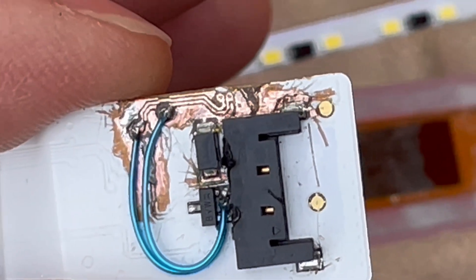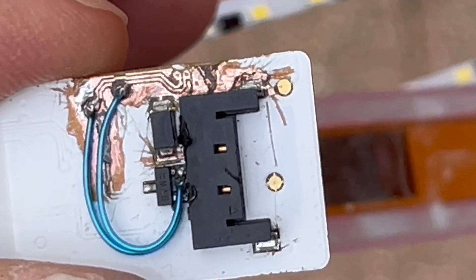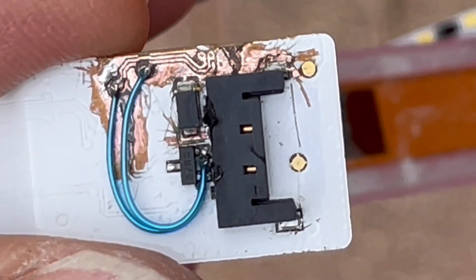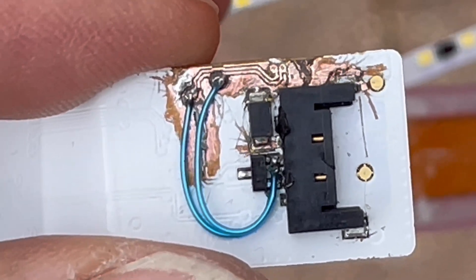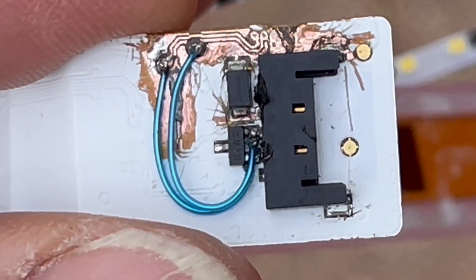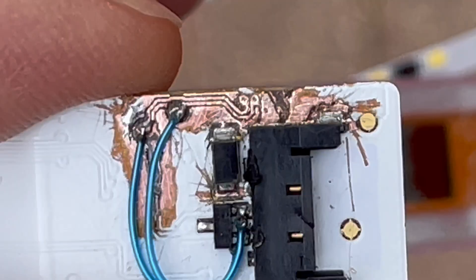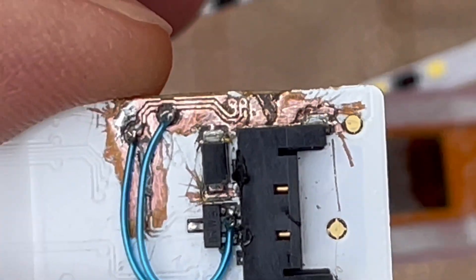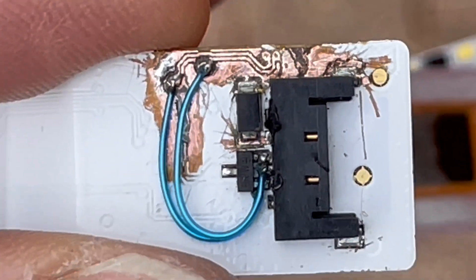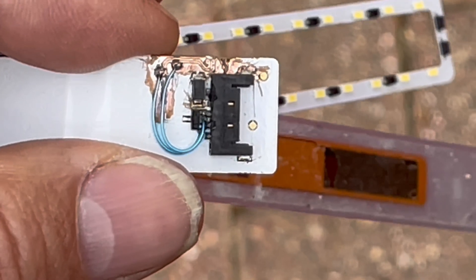There again is the fix — looks a bit of a mess to be honest. There was a lot of corrosion around those gold-coloured spots because they're exposed for testing reasons, but the water got in and electrolysed everything around it including the proper tracks. When I was scratching away at the tracks I think it actually went through to the next layer of the circuit board — that's why it got confusing. There are two wires from either side of the right-hand side of that transistor going on to two of those gold-circle test points. I wouldn't suggest trying it yourself — it is very, very difficult. You have to have a very fine wire and a very fine soldering iron and a lot of patience.